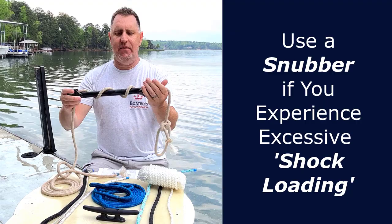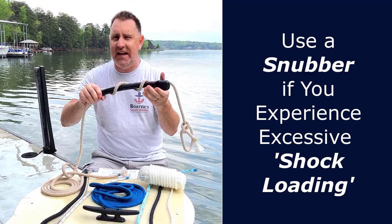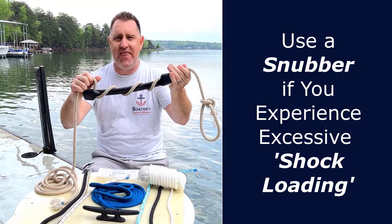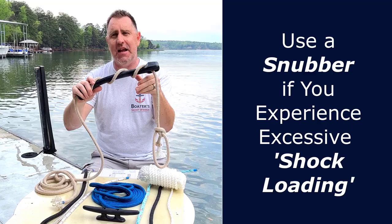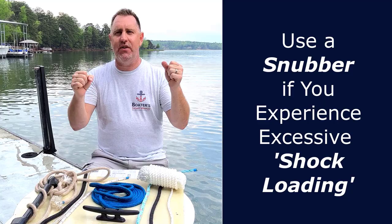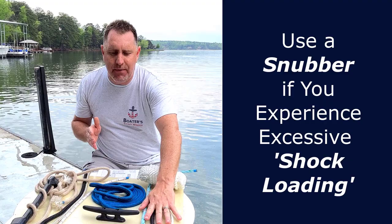If you have a cruiser and you overnight a lot, sometimes the dock lines can be a little tight and you're getting a lot of bouncing from waves. You can put a snubber on — just slide it onto the bitter end. When you hit a really big wave and the line hits its max stretch, the rubber snubber is going to stretch a little bit and give a nice easy spring. They make different sizes. If you sleep on the boat and that jolting is annoying, a snubber makes a big difference — and in that situation you're probably going to go with three strand.